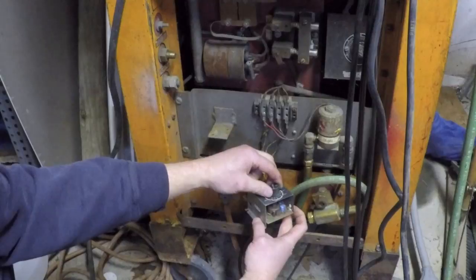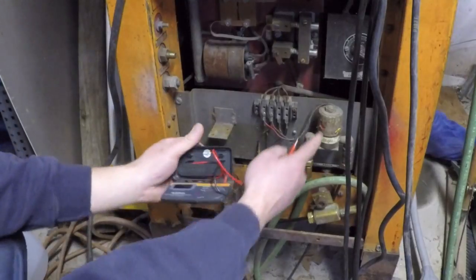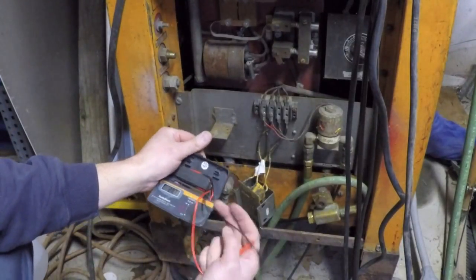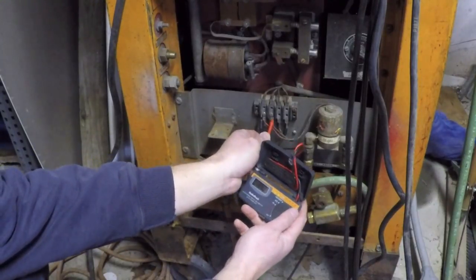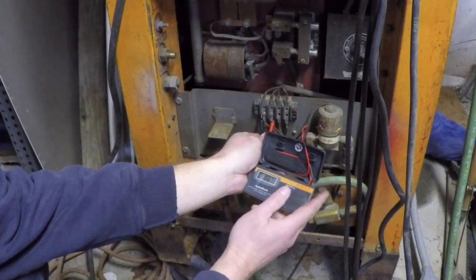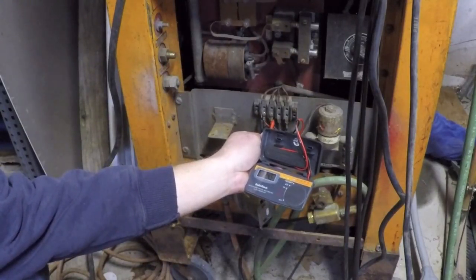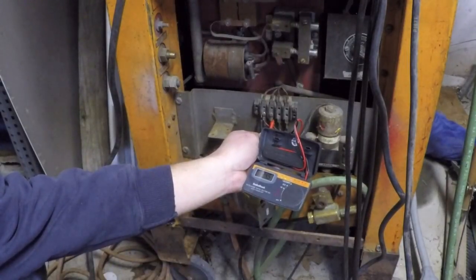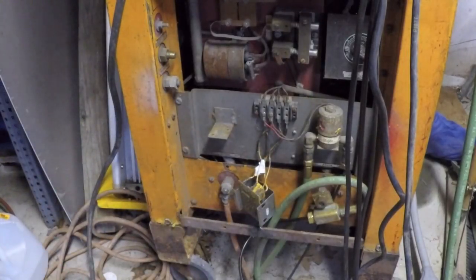Leave that control at about the 10 second mark. I think it's working. It's hard to hear the solenoid over the sound of this huge fan. Look at the voltage going to the connections. Energized. Take my foot off the pedal. Stays energized. And 10 seconds later, shuts off. Working perfect. All right. See if we can't break it.